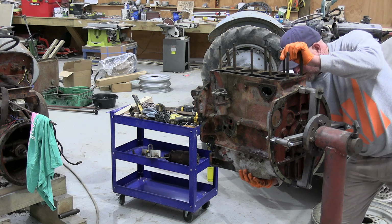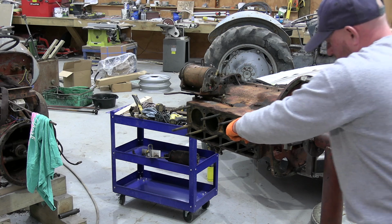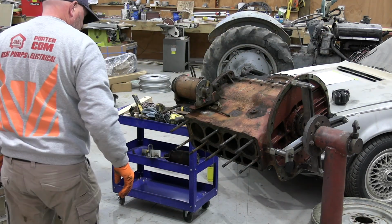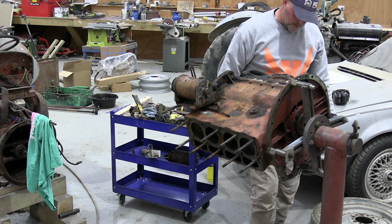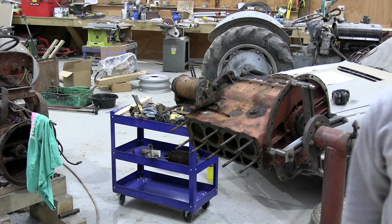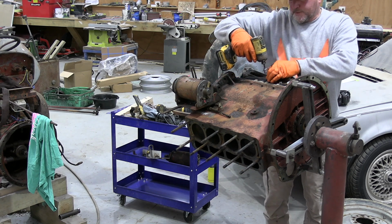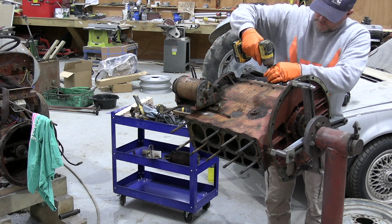Hopefully this should just. Just let it drain a little bit into there. Always drain. So I should flick that over all the way in a minute once it's drained. Before I take the sump off, I'm going to take this sieve out here. So this is a little sieve that goes just before the oil pickup. Come out the nuts.